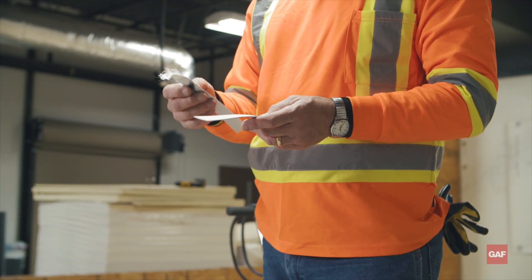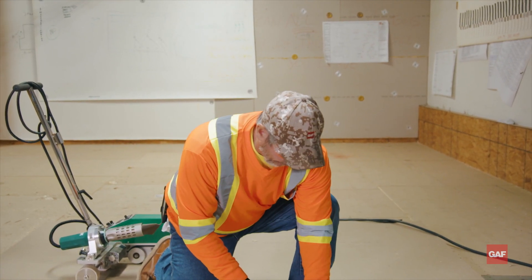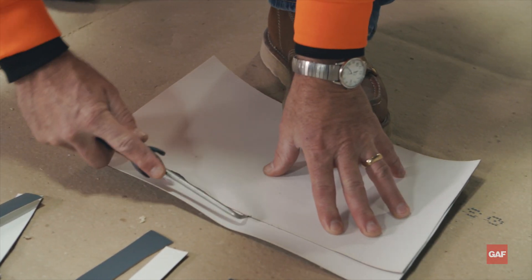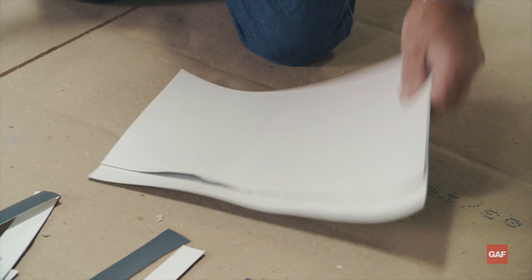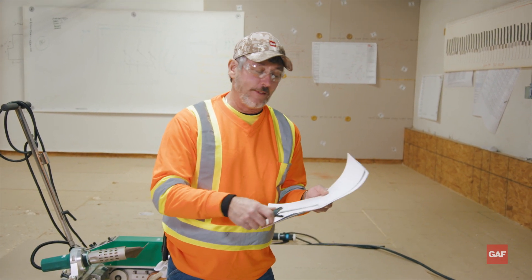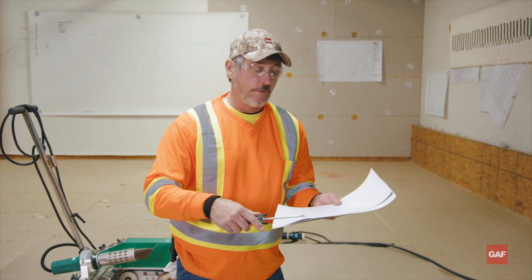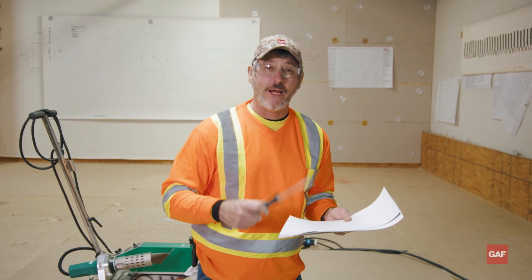The 1,148 is too hot. You can see the sample I pulled — I can see the gray. Even with my probe, I can't probe that open. So this roof could sit — say you welded at 1,148 that day, the guy went back to probe it, and he's not going to probe it open. But six weeks, a month, two months, a year down the road, these seams are going to start popping. It's so important that the guy doing the test welds pays attention when he's actually running that robot.